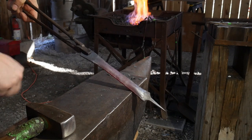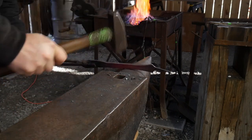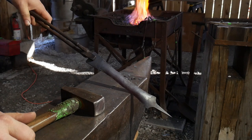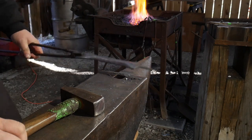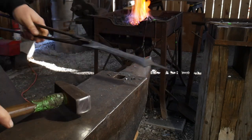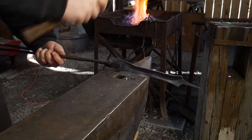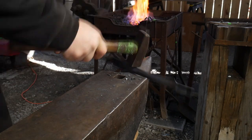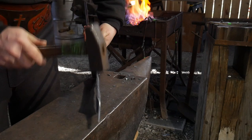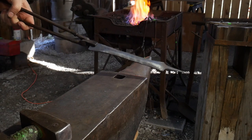For this particular handle I'm actually going to leave the cup that you see in it. I like to have a little bit of roundness or radius to the handle — I feel like it's more comfortable to hold. When I've sold skillets in the past, people really enjoyed when there was a little bit of dome to the skillet handles; they just feel a little bit better in the hand. There's always the option of texturing first — you can ball peen, you can cross peen texture it. With a blank like this there's lots of room to individualize your own skillets. We've simply eliminated the guesswork and all the hard work to get to this preform shape.